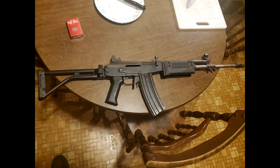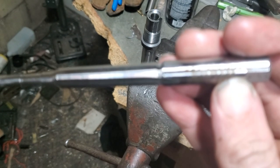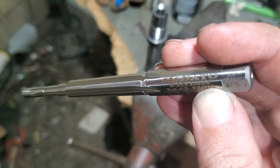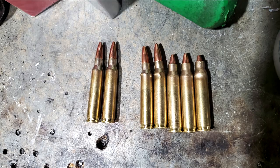One thing I didn't account for, though. The amount of metal I took off the shoulder moved the face of the barrel further into the receiver. The bolt wouldn't close, the chamber was now too short. I took a file to the face of the barrel until it cleared the bolt. Extractor cut was still good, and little by little I used my 5.56 chamber reamer to take just a little bit off the chamber until it was headspaced again. We're golden. I test cycled a few rounds though.